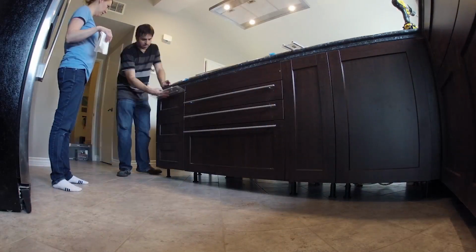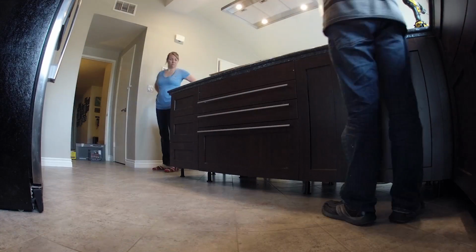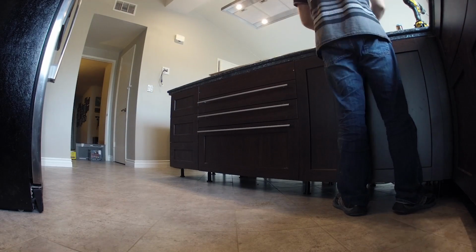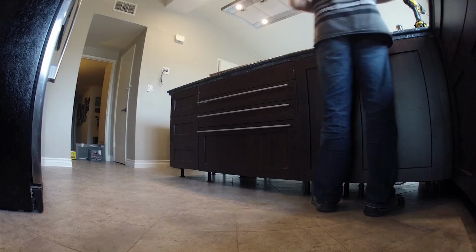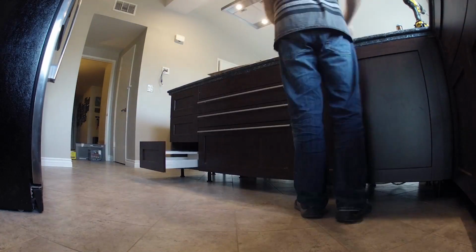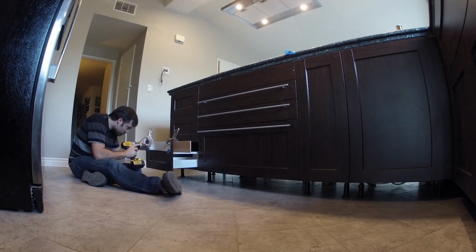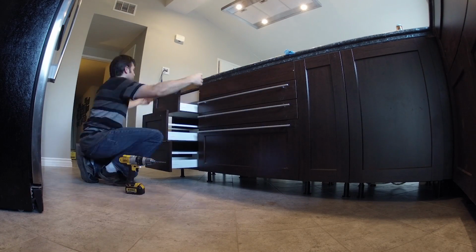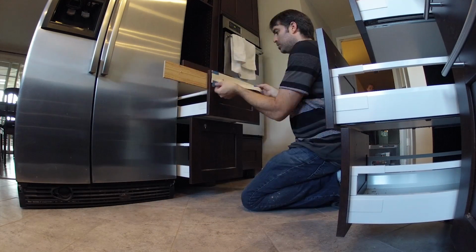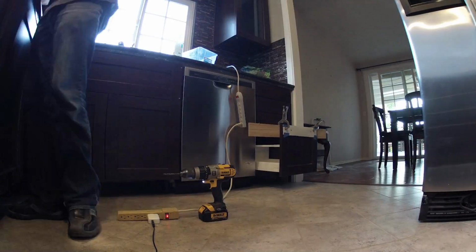handles. So here you see I've got the 3 handles on the sliding drawers. This is beneath the stove top. As I moved around the kitchen, I tried to do them in groups based on the size of the drawers or doors. So now I'm moving on to the 18-inch drawers and doors. Again, I just made another little template on paper, and just using blue tape to move the same template around and drill through the exact same holes again and again.